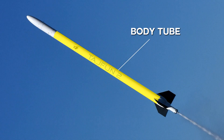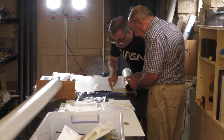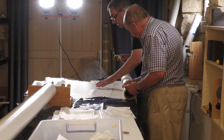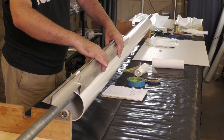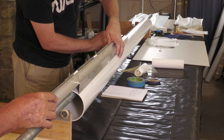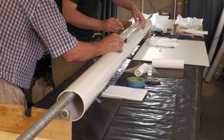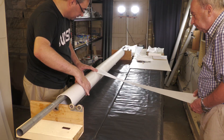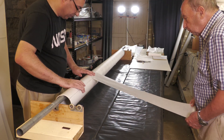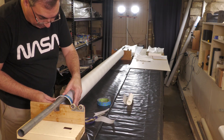Let's start on the main body tube. The body tube is just made from plain weave fiberglass. We decided not to go with carbon fiber for this build as the fiberglass is much cheaper and the carbon fiber strength is just not needed. We mark a couple of lines on opposite sides of the mandrel to help us align the leading edge of the cloth. Wrapping the paper onto the mandrel took about 15 minutes to get it just right so there weren't any folds and the paper was nice and snug against the mandrel.